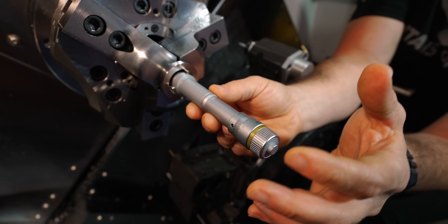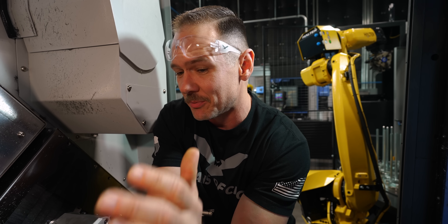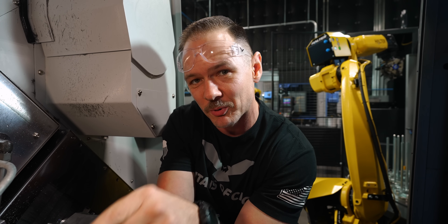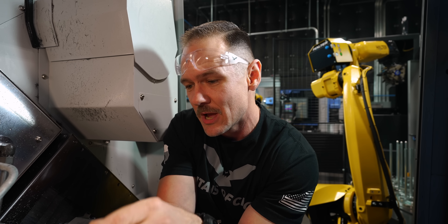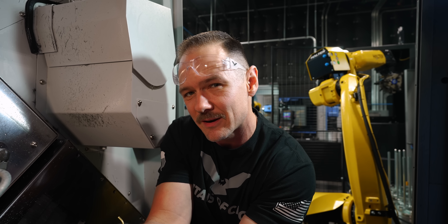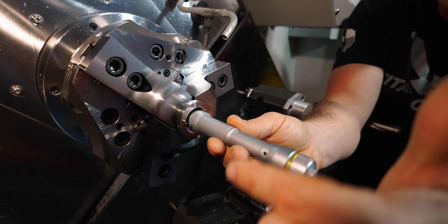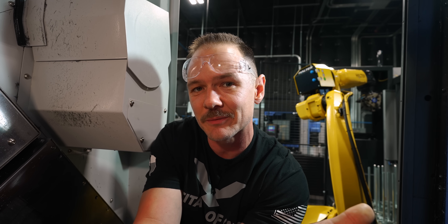We finished up our ID on Op 2. This feature is only about 50 thou deep, so it's a little tricky to measure, to be honest. It says it's perfect here on my inside micrometer, but we're going to wait to run it on the CMM and make sure that my touch here matches my results over there. We have one more feature to machine — our holes here on the front — and after that, we'll be Nitronic 60 machined to complete.